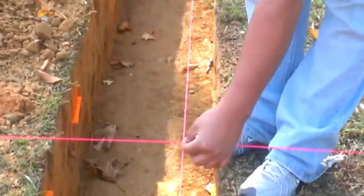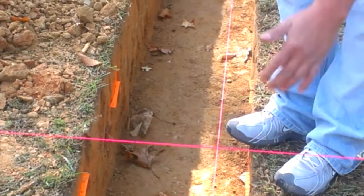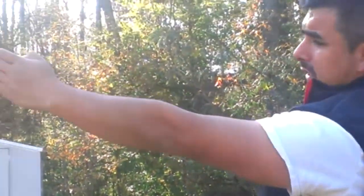When you're working to dig a trench, we use shovels and regular handheld tools — or you can use heavy machinery, or just hire more people to help you out. But first you need to trace the lines. I use a lot of this type of material — you can buy this; it's like a masonry twine.